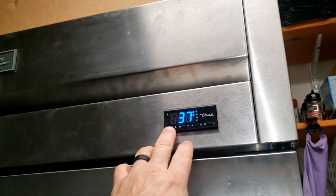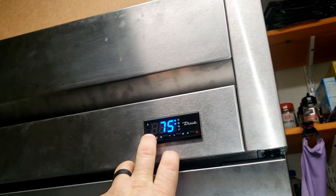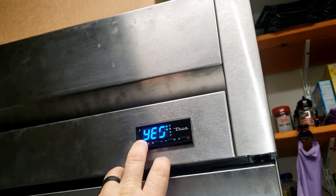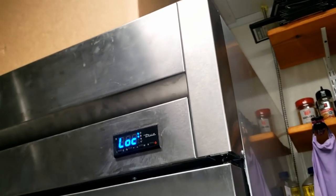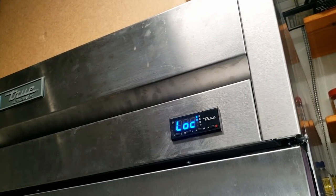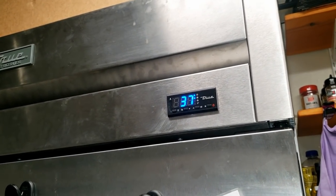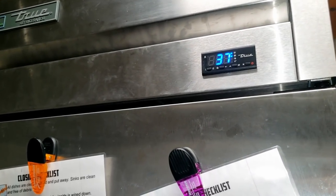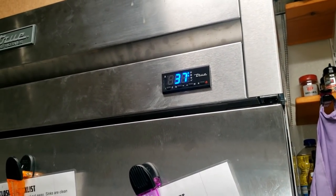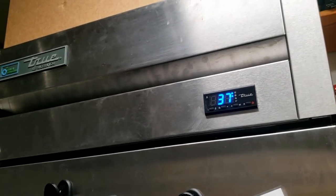We're going to check our temperature sensors because they've changed positions a few times, and check our programming. He just turned it on - both temperature sensors are in that area. We're also going to find out whether it's set up for accumulative defrost or time defrost. From what I've learned, the time defrost has been the most reliable and had the least problems. They try to be all efficient and that tends to not work out so well.